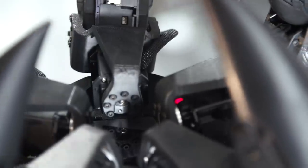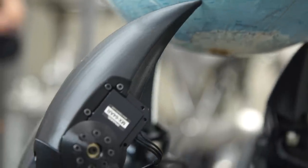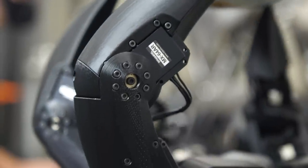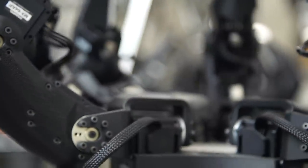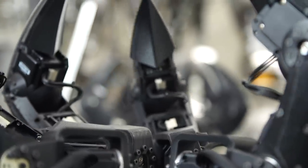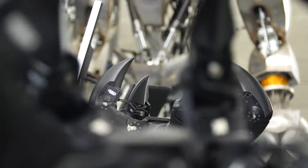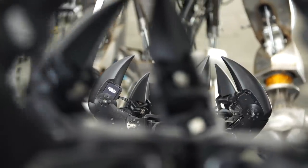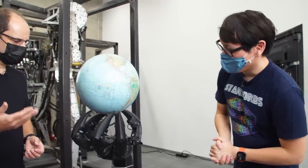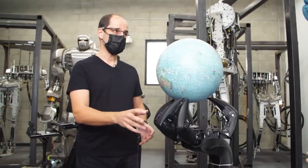And when I use the word walk, it's because it's basically a walking machine — it has a walking gait. It's a pentapod. It's a five-legged spider lying on its back, spinning a ball like a circus animal. And that trigonometry — what you solve for is a way to send instructions based on the design: the number of joints, the distance between the joints, so that you know where the tip of that finger is at all times. And then you can program an animation. We call it inverse kinematics. In this case, I'm using trigonometry to determine the inverse kinematics because luckily the fingers are reasonably simple.